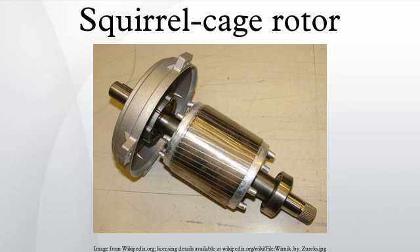The number of bars on the squirrel cage determines to what extent the induced currents are fed back to the stator coils and hence the current through them. The constructions that offer the least feedback employ prime numbers of bars. The iron core serves to carry the magnetic field through the rotor conductors. Because the magnetic field in the rotor is alternating with time, the core uses constructions similar to a transformer core to reduce core energy losses.